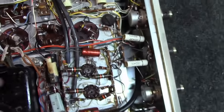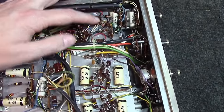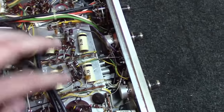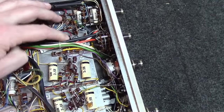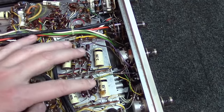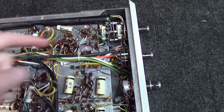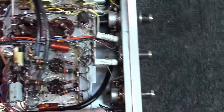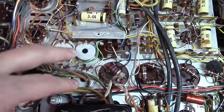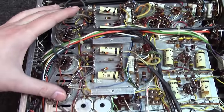And what they do is they establish a 48 volt circuit here that ultimately then goes across these 4 tubes here. So they're the DC providing heaters, providing voltage to your heaters and your tubes here on the front end. So it's kind of 12, 12, 12, 12, and that gives you your 48 volts across there. The next thing it does is it also feeds over here to the bias circuit and feeds your bias on the output tubes here.